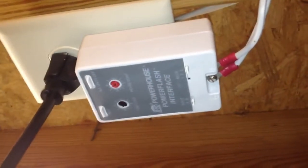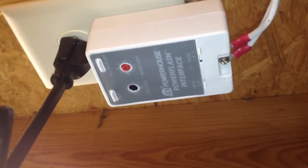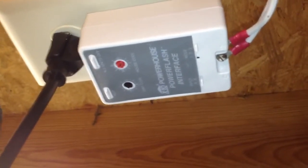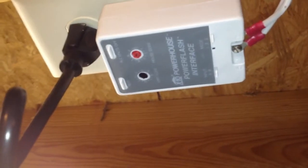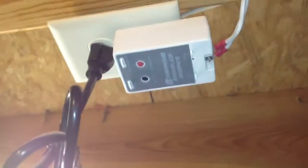When one of the smoke alarms activates, you get the nine volt pulse, and that pulse activates the PSC 01. It's in mode 3, input A. I've got AHP looking for activation of that particular signal, and when it senses that signal it's triggered to send a text to my phone which says 'fire alarm.'